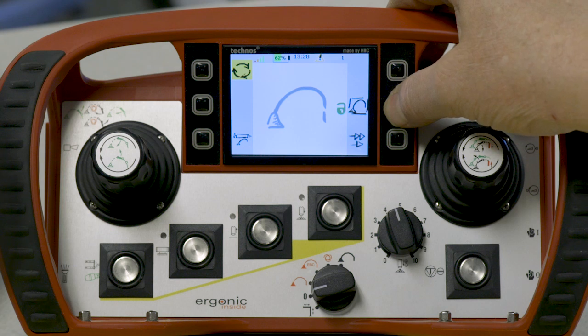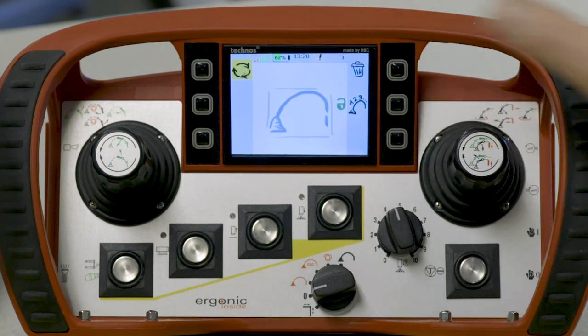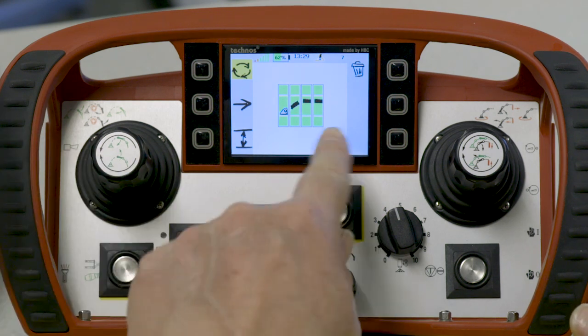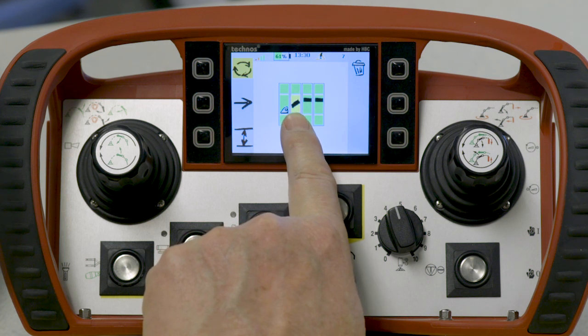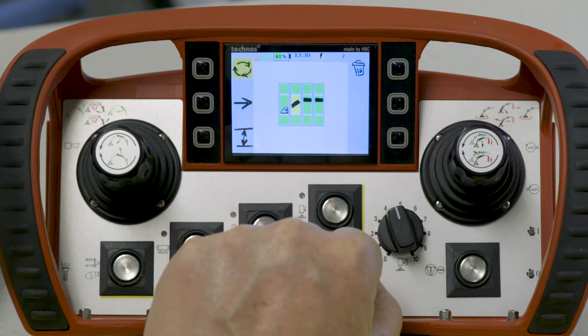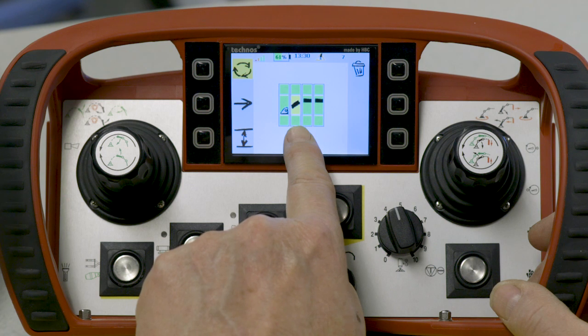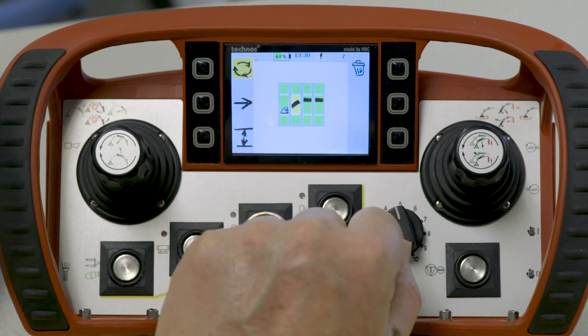Now I select locking sections. With the standard remote, we can lock individual arms. For example, if you're boomed up to a building and your A section is right next to the guardrail on the fourth floor, you want to lock that arm so it doesn't move up or down, but you still want to be able to move swing and the rest of the arms. We would move the cursor to the arm we want to highlight, put the boom in the position we want it to stay in, and then select the upper and lower limits. The icon lights up red, and now that arm — even if you bump the joystick — won't move.